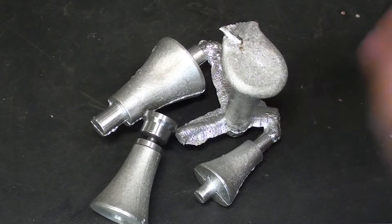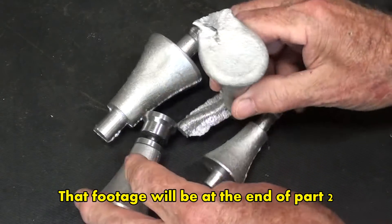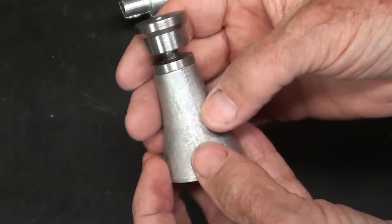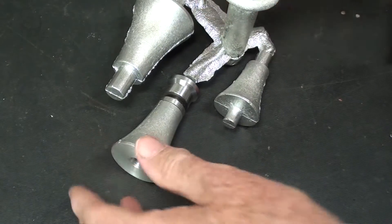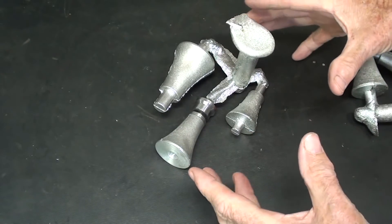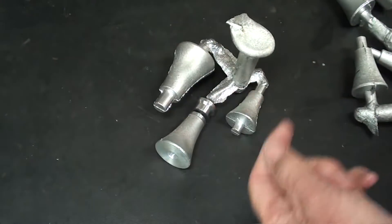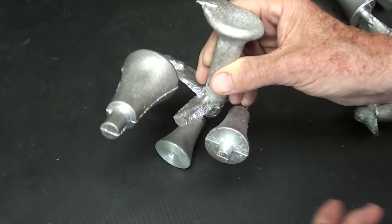From those three patterns I made castings, and the footage will be at the end. These are the original three castings, and they are defective — look at the shrinkage here in the thick one, and even this one is a reject. I went ahead and used them anyway as prototypes. Why the shrinkage? I got lazy — it was hot out and I used too small a flask, there just wasn't room for the risers. You can see how thin my gates are; naturally it froze off.